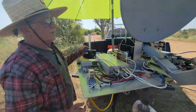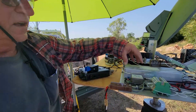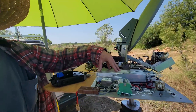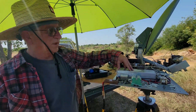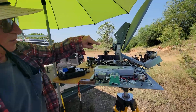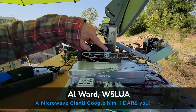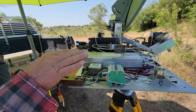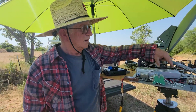The other side over here — we start from the front. The same 144 MHz IF, using an FT-817. All of this stuff over here is inside this box. It has a 10.224 gigahertz oscillator; it mixes with 144 — not the harmonic, it mixes directly with 144. That in turn goes out through this 3-watt power amplifier. This is a GaAsFET LNA made by Al Ward, W5LUA. This 10 megahertz reference oscillator keeps it locked to one frequency. It has a digital synthesizer inside that generates the 10.224, and this is its reference lock point.